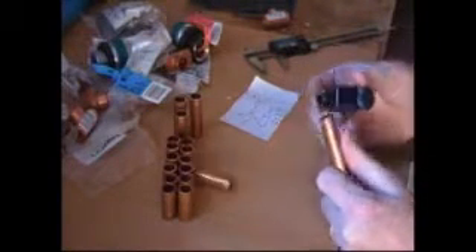I'm going to take you through what I'm doing here to build this thing. I basically decided I need to cut a whole bunch of little pieces of tubing in order to assemble the ends. Some of the things I'm doing with the ends that are a little different is adding the ability to put a thermometer in. Here I'm showing you the reducing fitting — I'm going to have to drill all the way through this. There's a stop on the inside, and this one is going to actually slip over the soft copper inner cooling tube.